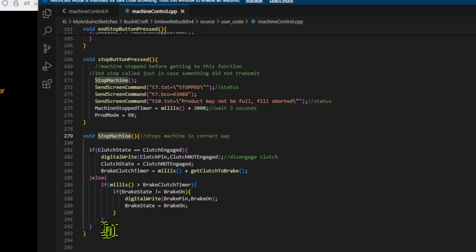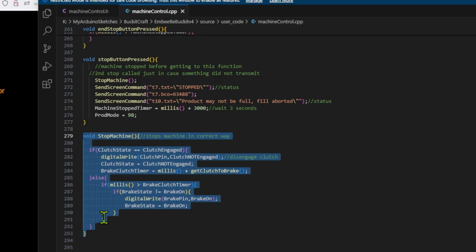And what I want you to understand from a fail-safe point of view is, if you have items like this that must be in the right order, try and make sure that they are all in one function, maybe two at the most. But if you like, write a very specific piece of code to deal with that safety critical item, so that as you make alterations elsewhere in your code, this always remains constant. That means you can test the item, make sure that it all works, and then once you've got it, if you like, that is locked down. That never ever gets changed again.